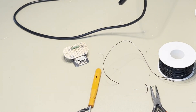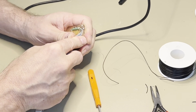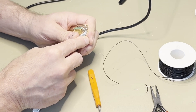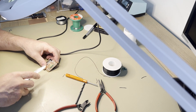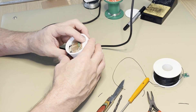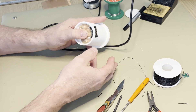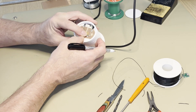So I have my box and I've also put the ESP on a piece of board and added a connector for USB so I can download and monitor if needed. I'm completing the board now to fit it onto the box. It actually sticks out a bit from the box, but it doesn't matter so much — I think it will also be good for the Wi-Fi antenna.